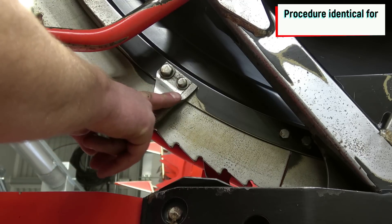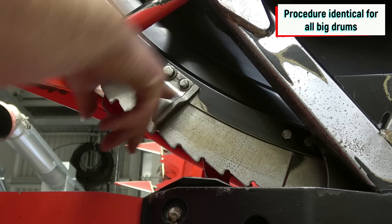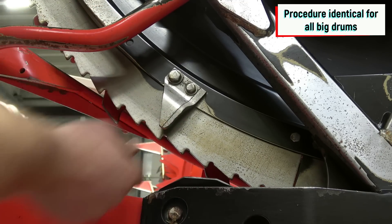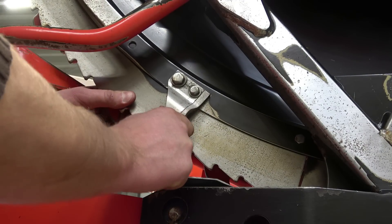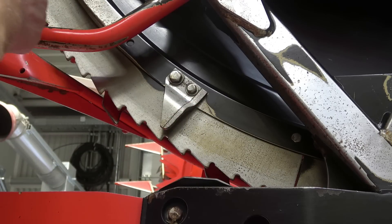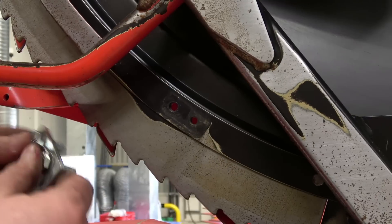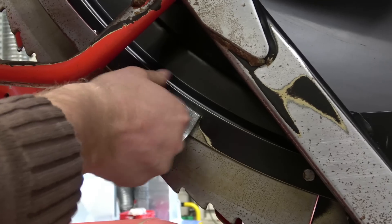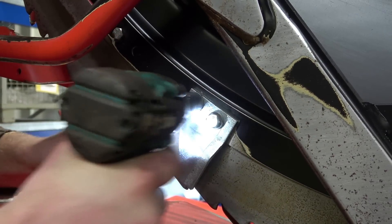This is the cleaner underneath the blades. There are two pieces per rotor installed opposite each other. If the cleaner is worn, you should replace it immediately. If you do not do this in time, you will again get problems with material accumulating at the divider points and disturbing the even crop flow. Let's replace the cleaners. Installing new cleaners, you always have to use new nuts and bolts and tighten them properly. It's always important to replace both scrapers to avoid imbalances.